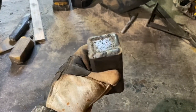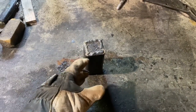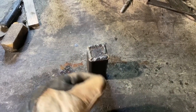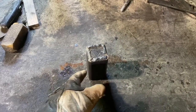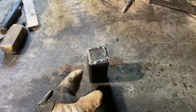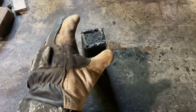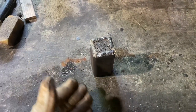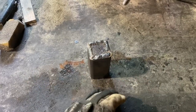The caps are welded on — it looks like hammered dog crap but it's solid. I didn't weld a work peg on, and the reason for that is that cracking and incomplete welding around the edges and ends of the billet is pretty common with canister. I'm thinking a way to mitigate that is to upset it first — compressing it that way before I square it up and draw it out into a bar. I don't know if it's going to work, it's just an idea, but I want to see if I get a more complete weld doing that.